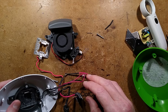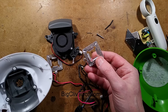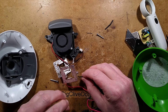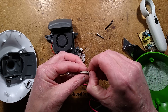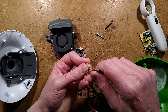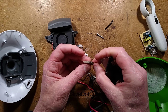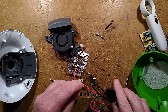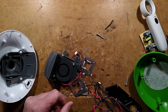My apologies if you bought one of these based on that video - it was just an interesting novel thing to take apart, but it does appear to have weaknesses. The thing is just literally sandwiched between these connections. There's the little black sooty skid mark as well - what a shame. I suppose that technically, given its construction, you could chop the corners off and get a bit more life out of it. You could actually file or scrape it off, but it's probably not ideal - it's going to do it again because it's showing signs of gradually bridging across. Interesting, well worth taking apart, but a disappointing product design. I wonder how many of those they made and sold.